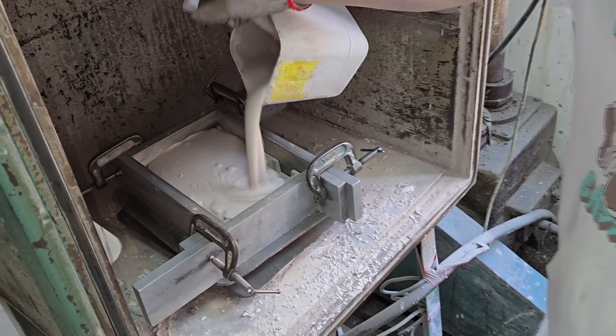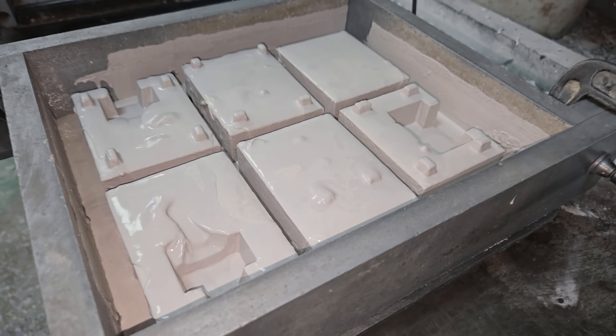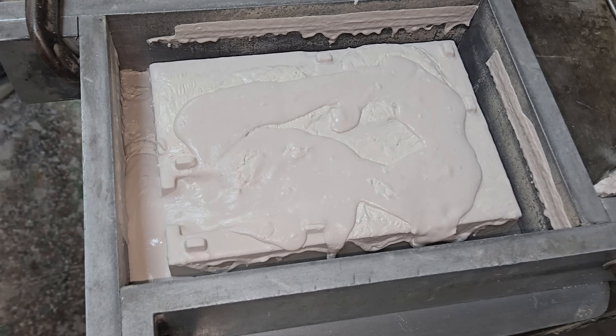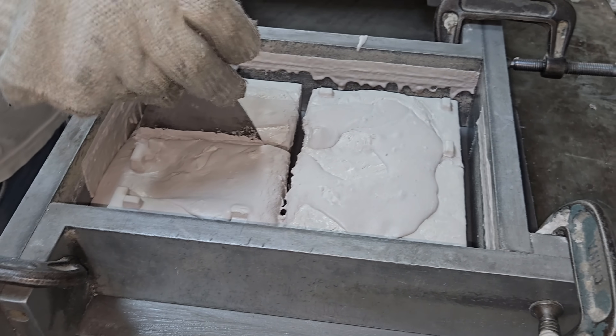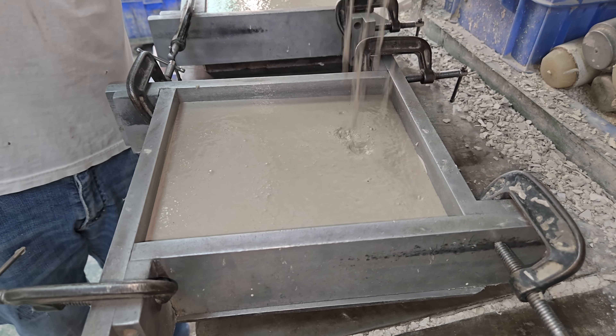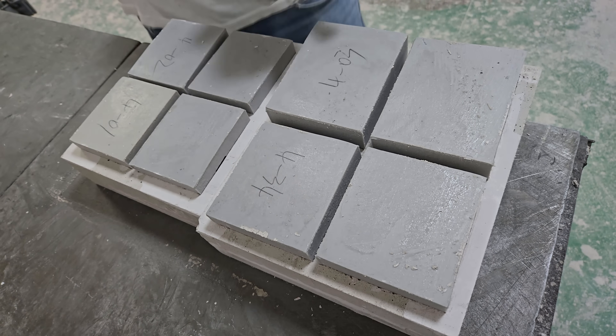The gray silicone blocks are placed in a frame, and fine ceramic is poured over the fine details. Again they're mindful of air bubbles and build this up in multiple layers. The ceramic investment molds are big, each holding several of the silicone blocks. Once the details are carefully covered in fine ceramic, the blocks are separated and repositioned, and bulk ceramic is poured around everything to form the structural component. Once dried, the silicone blocks can be popped out with compressed air — no mold release agent, just compressed air.